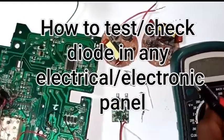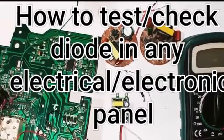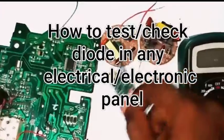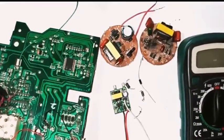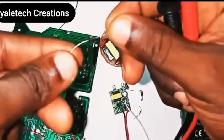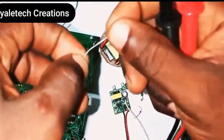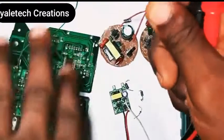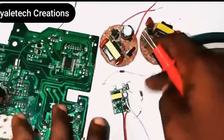Hello, what's up guys, it's your boy Yo Tech. Today I will be sharing with you how to test your diode. I have some dead ones and some single ones — I have different types on different panels. We'll be testing them with your multimeter. The first thing to know about a diode is that it will only read in one direction. If it reads at both sides, that means the diode is faulty.